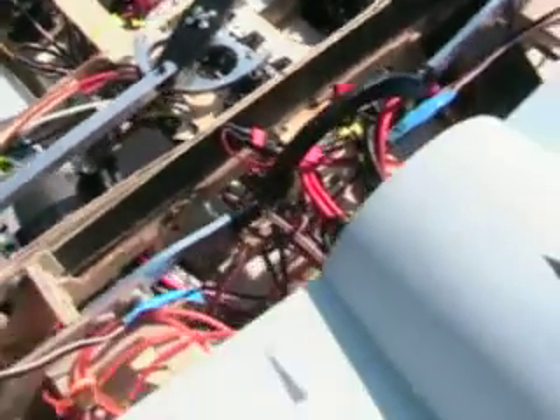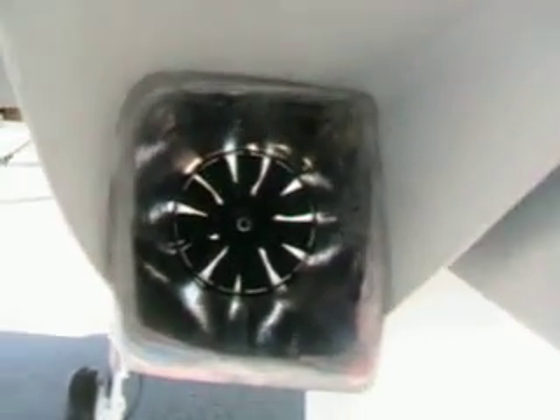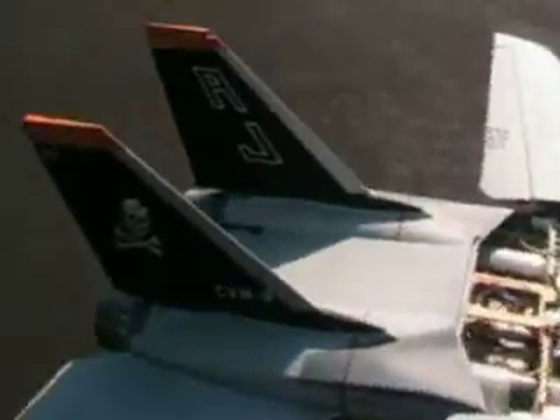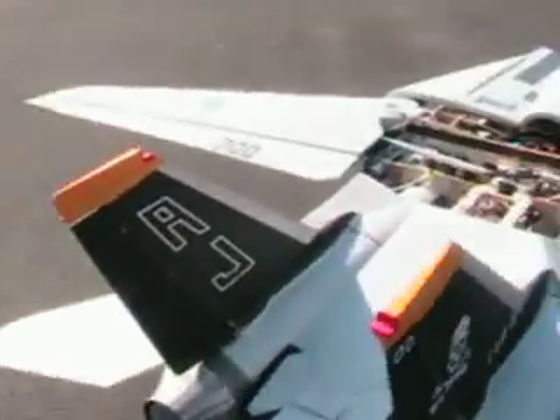Ducting for that worked out really well. The intake ducts — the fan just fits in the nacelle. So the intake going straight back to the fan takes up a large amount of air. 120% of fan sweep area is the intake. And that goes back to the exhaust, which is 90% fan sweep — I'll do that to 85 or so. And there's the fan.